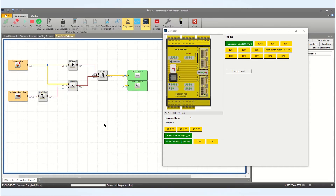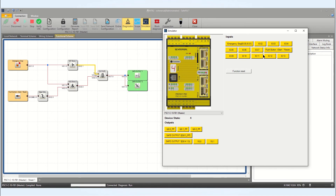Here's an example using our simulation tool. Using the same example, I've added falling edge detection to the programming. Our system is running and our safety outputs are high. If I use our e-stop, our safety outputs will drop, keeping us safe. If I manipulate the reset button by holding it down and engage our e-stop, you'll see that our safety outputs do not go high — they'll only go high once I release the reset button.